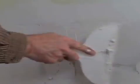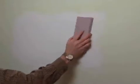When the surface is smooth, apply a second coat of compound and smooth it off with an 8-inch joint finishing knife. Feather this layer out about 2 inches beyond your first coat. Let the compound dry for 24 hours and sand with 120 grit sandpaper fixed to a large flat board. There are also commercial tools available for this purpose.